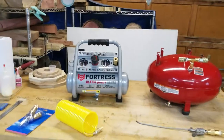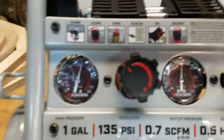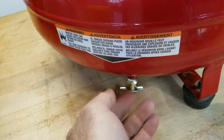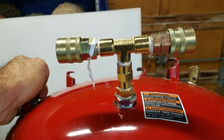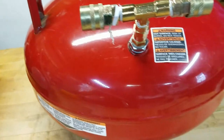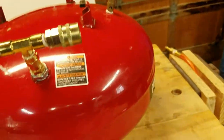It's all done. I'm going to show you everything here. Obviously that's the new compressor, which I'll let you hear in a minute. I tested it, filled it up — it works fine. This is what I did on the old tank: I had to put a new pressure cock on the bottom, and I put this T so I could have a line coming in from the new compressor and then out to whatever you want. I bought one of these splitters so I could just plug that in and attach any hoses I want.